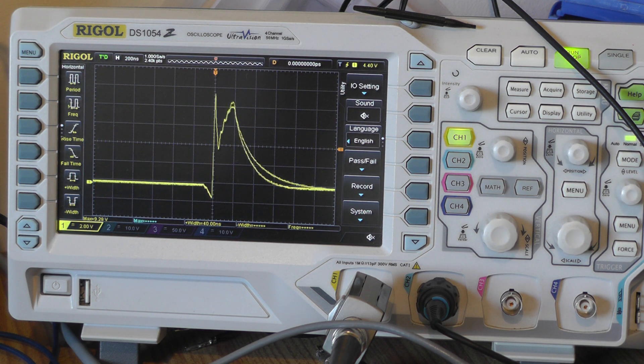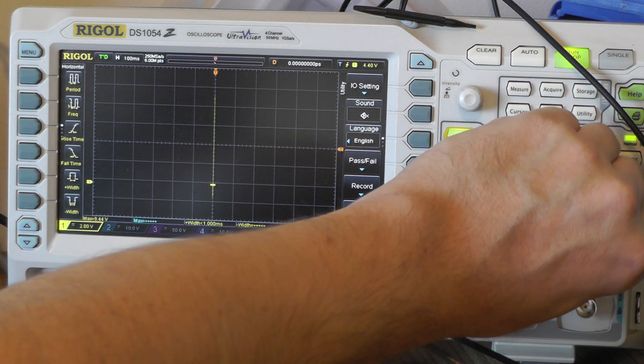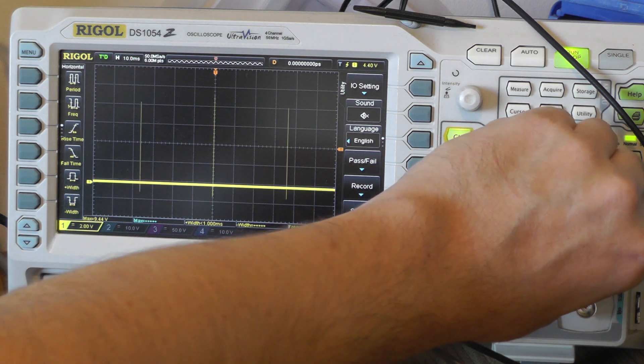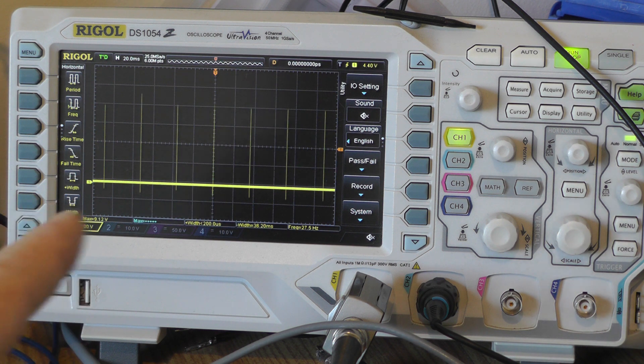We can't measure this directly with the oscilloscope because the transformer is 10-to-1 and we're feeding it 800 volts, giving us eight kilovolts coming out. So I've hooked up a current probe and we can see a pulse whose full-width half-maximum is about 300 nanoseconds. So that's a particularly fast pulse — this is what the tube is seeing across the pre-ionization rails. The scope says 27.5 Hz, so 27 and a half times per second we're hitting it with a ~200 nanosecond, 8,000 volt pulse. I assume the control circuitry also does some synchronization — when you say fire once per second, it'll move the main ignition pulse to fit in with one of these pre-ionization pulses.